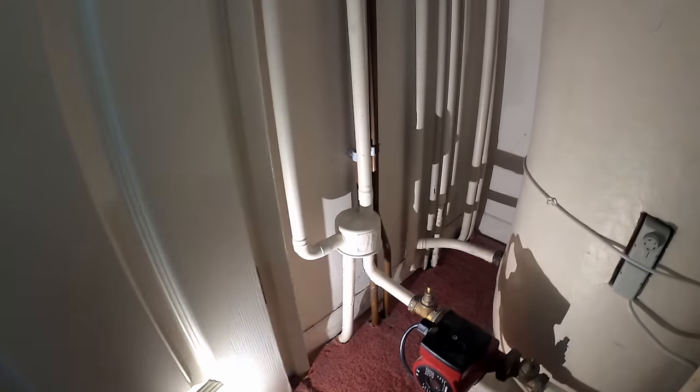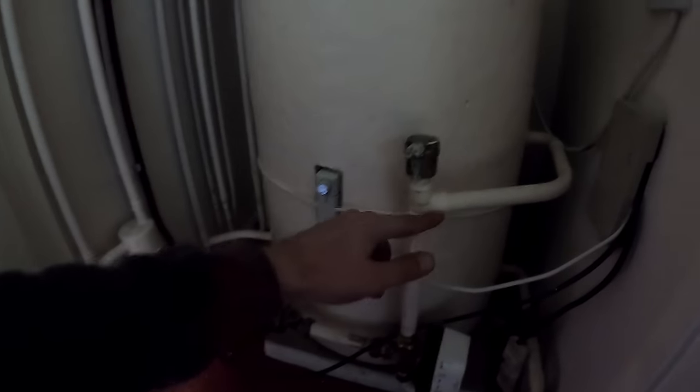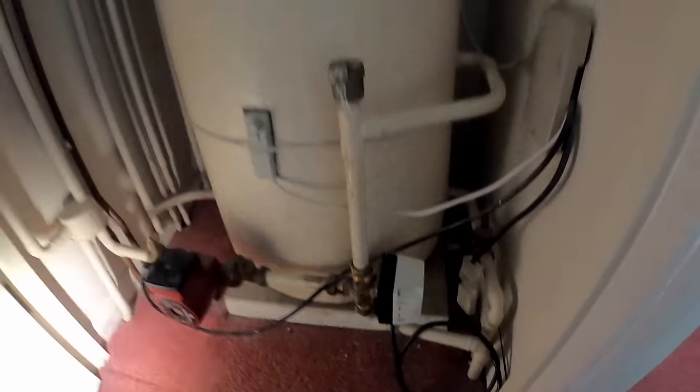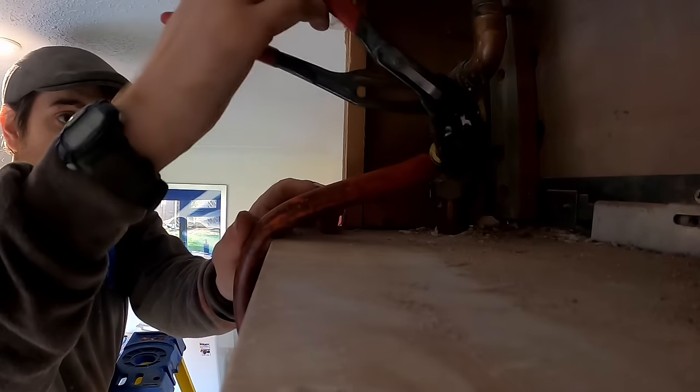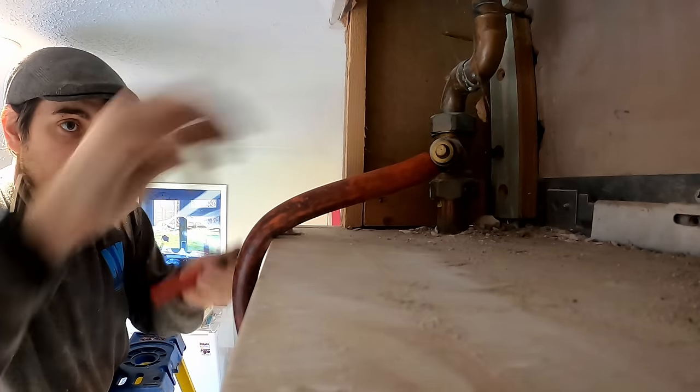Vent, cold feed — these air sets sometimes block, and I don't actually like them very much. Through our pump, into our three-port valve — B-port for the hot water around the coil. That's our return and that's our flow to our heating. So it's a standard Y-plan setup — cylinder stat, room stat, and programmer. We'll see if this one works; it looks alright actually.